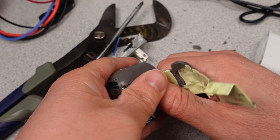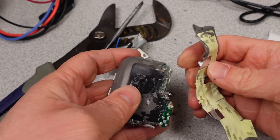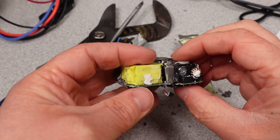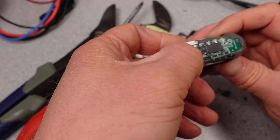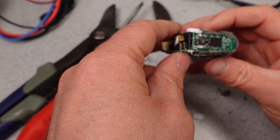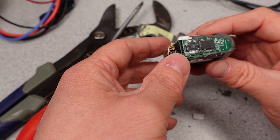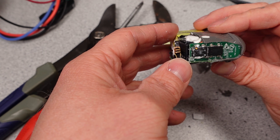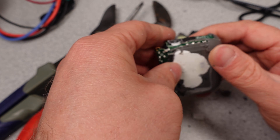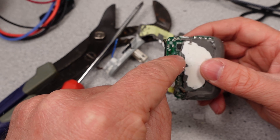This part of the video is going to be a bit of a slideshow since it's easier to go over these one piece at a time with a single shot of the relevant thing. There are a few printed circuit boards or PCBs in this power adapter. The primary board does the main switching and houses the larger components. Then this has a separate PCB for the bridge rectifiers — two of them. That's unique. This also has a separate PCB for dealing with the USB side. Time to do some general analysis of the main components and see what's what.